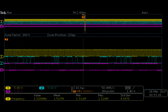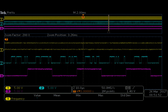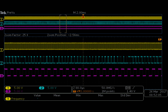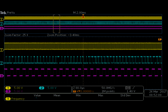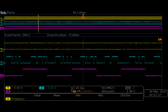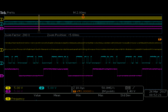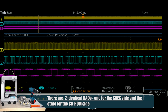What we see here is the music for Super Mario Kart. The center line is the data, and you can see it looks more like a signal - there are actually things coming out of it. The yellow at the top is the clock, the cyan in the middle is the data, and the magenta at the bottom is the left and right channel. It does the left channel, then the right channel, left channel, right channel - it just continually streams it over. This actually looks like good data here because we know the Super Nintendo DAC is working.